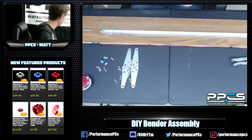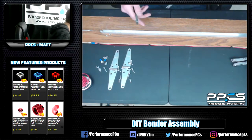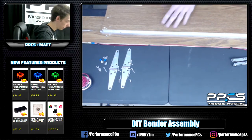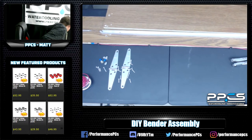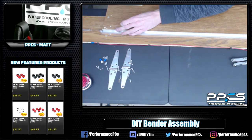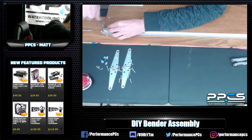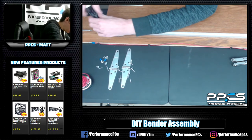Once you get the wire wrapped on there and the wire end on, you can just screw that one down and you pretty much have your wire in place, which is essentially the entire bender. Next is the easy stuff — just screwing together wood panels with these hinges. We'll use the one bottom board here; this actually gets screwed down to the baseboard because this does not move. I just used some nice little half-inch wood screws. I drilled out the holes and countersunk them a bit with a bigger bit.